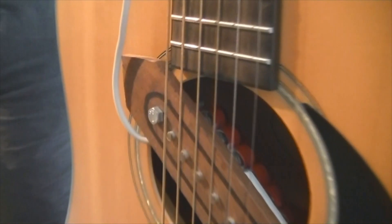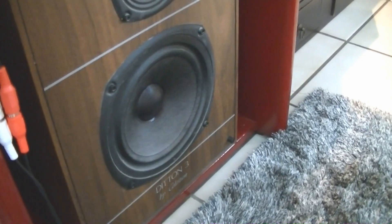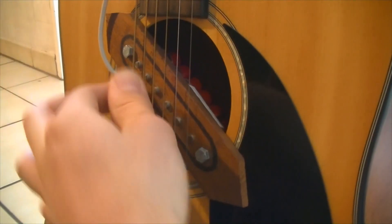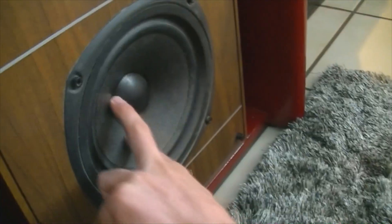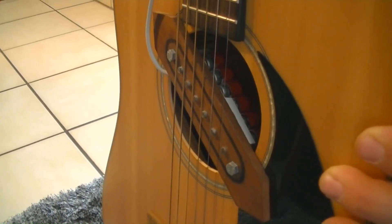A little experiment to illustrate the Larsen effect. I'll scratch the 110Hz string near the hi-fi speaker and see what happens. We notice that the sound is increasingly louder, and the string vibrates indefinitely. Unlike what one might think, it's not the electromagnetic sensor that causes the string vibration. When the string moves, the sensor generates an electrical signal representative of the vibrations of the string. The signal is amplified and the speaker diaphragm vibrates the same way. The sound has exactly the same tone as that of the string. Due to resonance, it vibrates with sound energy, and the phenomenon intensifies until reaching the amplifier's limit.